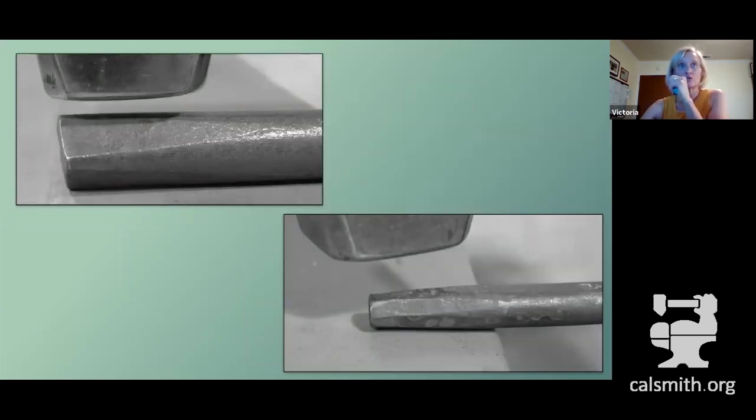Once you have your lazy square, you just take these unforged parts and turn it into an octagon. The octagon makes it very easy to see that it's a hand tool and it has a struck end, and that is your struck end. Once you have the end in the octagon in place, and again, I want to really caution against over forging this.